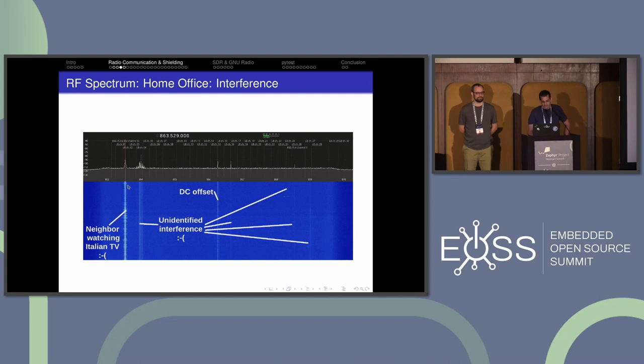And I also know this is kind of the channel 2 that we use, or it's very close to our channel. And I think that was the main reason why, when I was developing, often I was working on some feature and it worked quite nicely in the afternoon, but then towards the evening, I suddenly started getting more and more errors and I didn't know why. And then I fired up this application and I saw, oh, okay, I guess he's kind of a nice neighbor. He doesn't produce audible noise, but for me that would have been preferable because now he's producing RF noise.